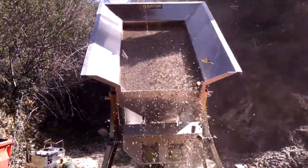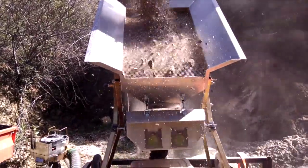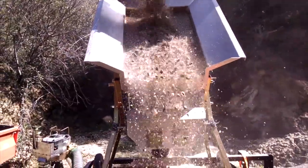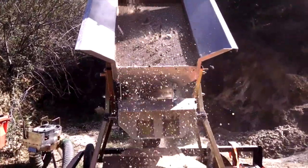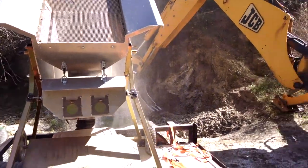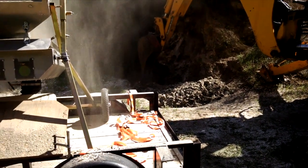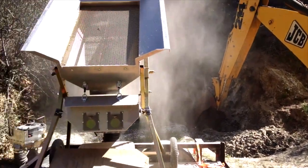You can see it's having no trouble working the material over. With the dry washer there were a couple of little issues. They should have probably set the top hopper a little flatter — it would have worked more efficiently on allowing the material to vibrate through the vibrating screen. Also, the actual flow control gate, which is a really important part of the dry washer, just broke the first day. We engineered it incorrectly but we'll get it fixed next time.